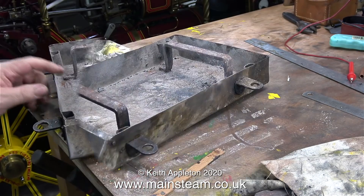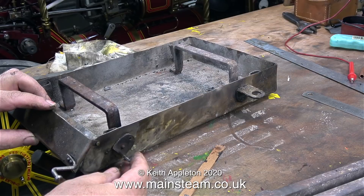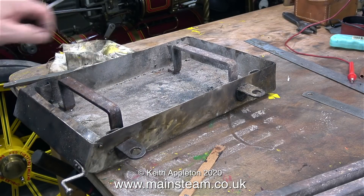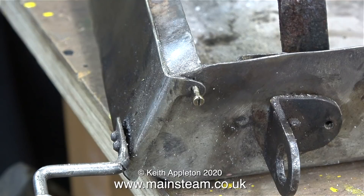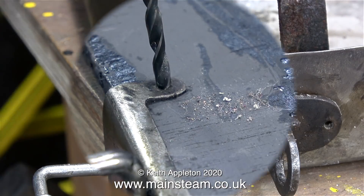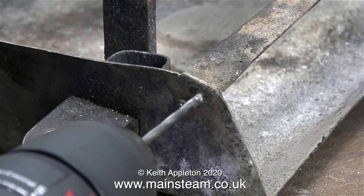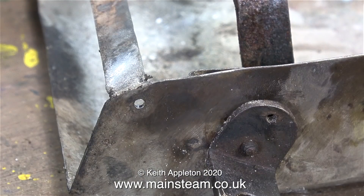Like all of this traction engine, this part is very well made. The mounting lugs are riveted to the ash pan and they're all okay apart from one, which I'm going to replace with a bolt. I'm also going to re-rivet the damper arm because it's very loose, and while I'm at it I'm going to change the bolts that hold the damper in place. This showman's engine was finished in 1996 and since then the small brass bolts holding the damper have been okay, but I think they're a bit feeble and they're getting a bit worn too.